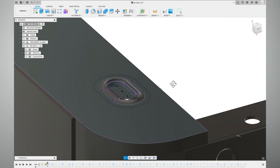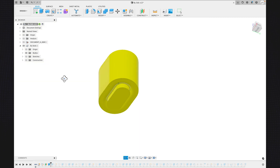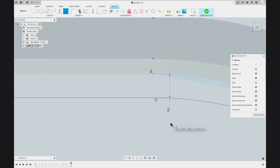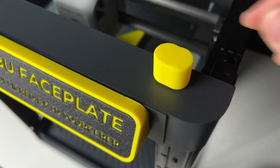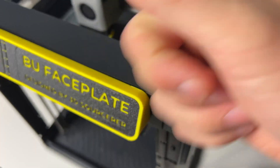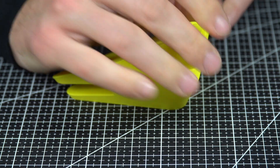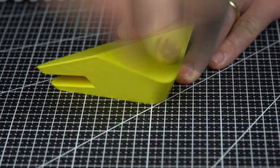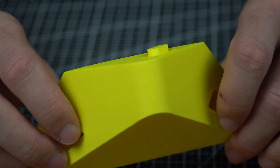To make the stick I used Project and Offset to create the profile sketch and then extruded it to the existing P1P step file in order to match the complex shape of the slot. I usually add a tolerance of 0.2mm to 3D prints, but since this was designed to be press fit I made it without any adjustments for tolerance because I wanted it to fit very tight so that the vibrations of the printer would not dislodge the stick and its attachments. I also considered the tolerances when designing the attachments. The boot stick will require some force when placing it into the attachment so you may need to tap it into place. I recommend printing one boot stick for each attachment because it is unlikely that you will be able to remove the boot stick from the attachment once it is in place.